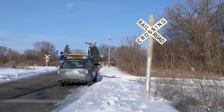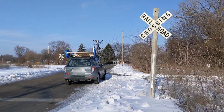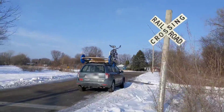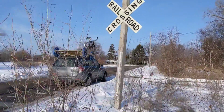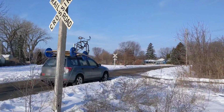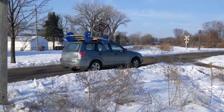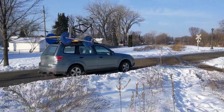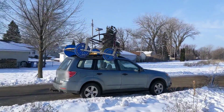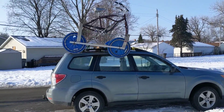Alright, so while that didn't work very well, we've at least identified a few problems with the rail bike. Namely, the frame is not strong enough. We kind of knew that. Had to go with wood, but it'd be better to go with aluminum on that. So I should get some metal for my frame. And then another problem is my wheels are not wide enough. So where they sit on the track, that surface is only really touching about half the track.